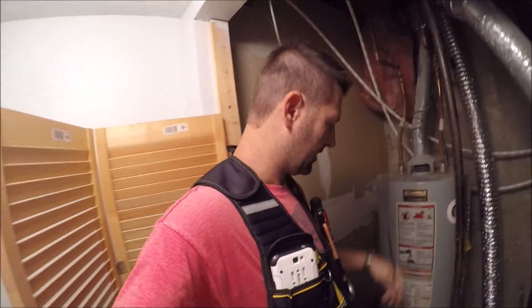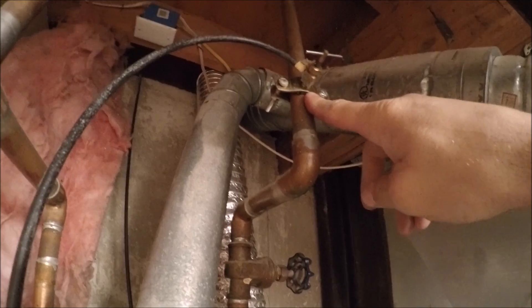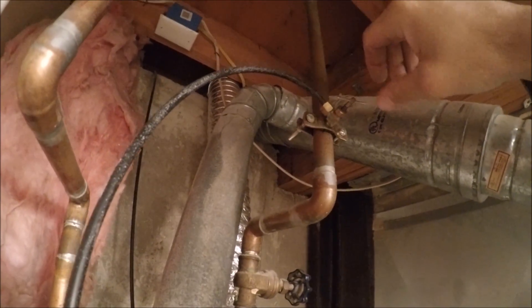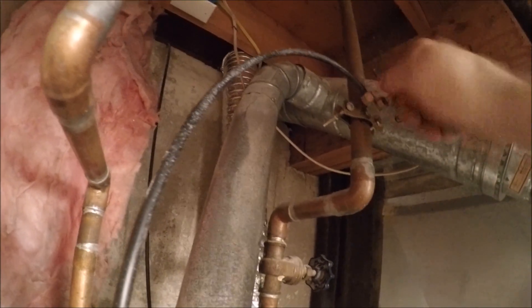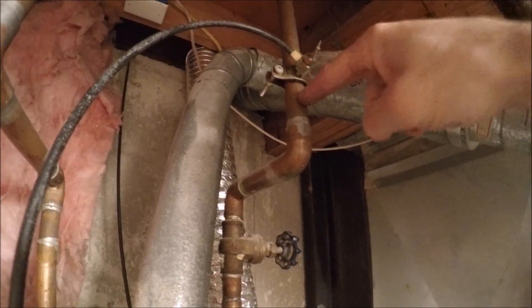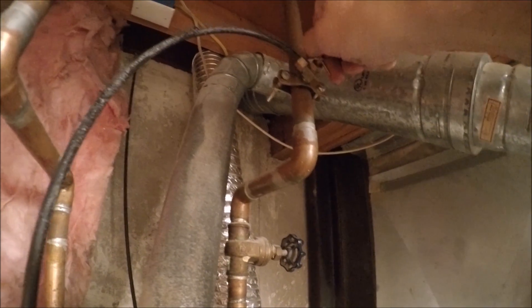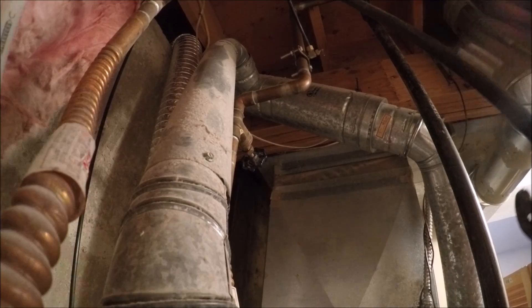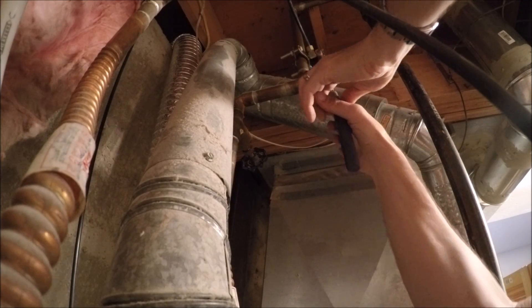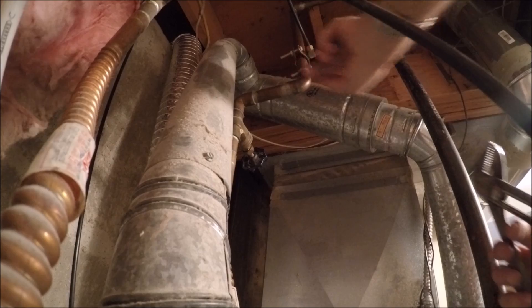We're now down in the basement. This right here is the black hose, and it goes up to a shutoff. I really don't like using these things — they don't always shut off very well. It's already spraying water all over the place. You just turn this in and it actually pokes a hole with a needle in this pipe. We're just going to try to reseat that needle. It's already dripping. There is a packing around here — sometimes you can tighten up this packing nut. It seems pretty loose, actually, but it will stop that drip.